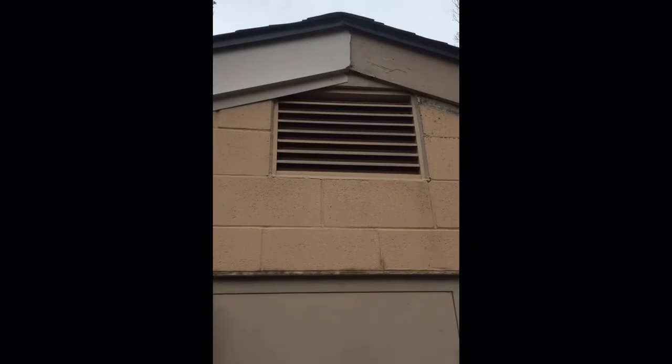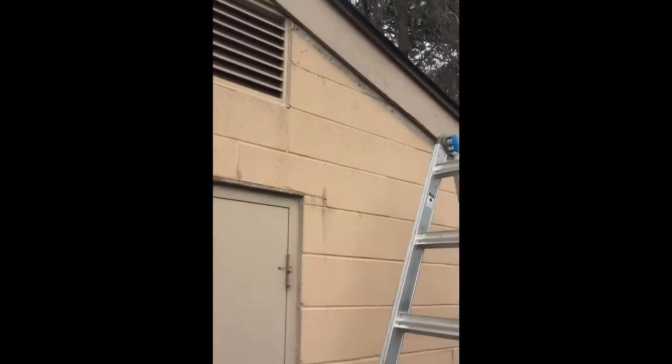What I used to do when I first started, I would do one and get it kind of looking like that, and bring my second piece up with me and kind of eyeball it and draw a pencil line down. But you can see I even drew the 5/12 pencil line on that, so I knew I could notch over about an inch for my overlap, and it lined up really good. So we should be in good shape.